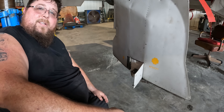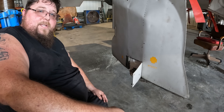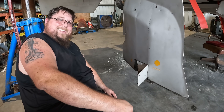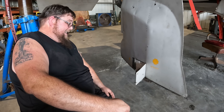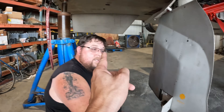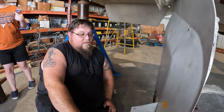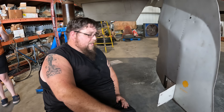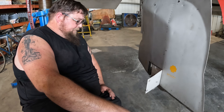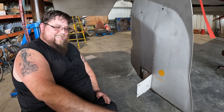It's kind of required, especially if we take this plane to different places where we need to change a tire. Absolutely — even for something as simple as taxiing around, or if you blow a tire out and you don't have any way to change it, airport ops tend to get real mad. They want that airplane off the runway soon. The alternative if we can't use that jack point is to chain the strut so it doesn't extend, but this was not a quick operation this morning — not something we can do operationally when we have the jet on the road.